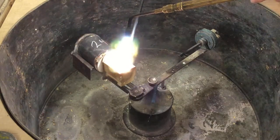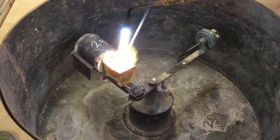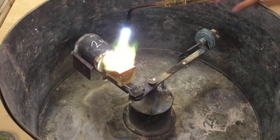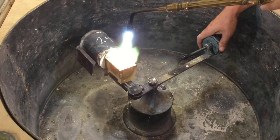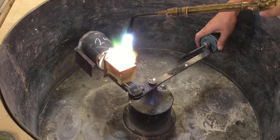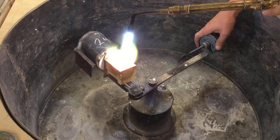Check that back area — this back area of the crucible is notorious for holding on just a little bit of your metal. Feels good. Let's do what we've got. Our metal is fully heated. We're going to pull the arm back, make sure that pin drops, keep our cover flame on the crucible, then let go and get my arm out of there while leaving the torch exactly where it is and yelling: casting! Three, two, one — casting!